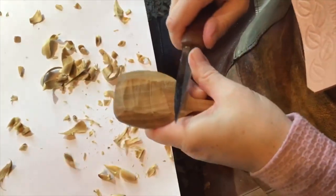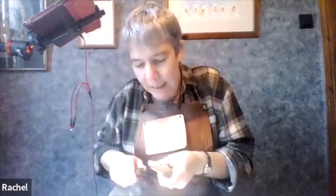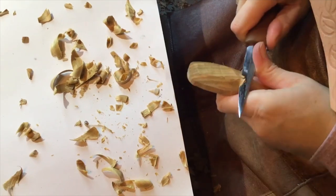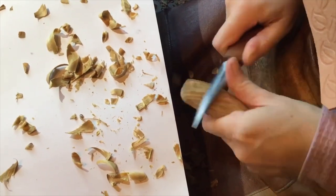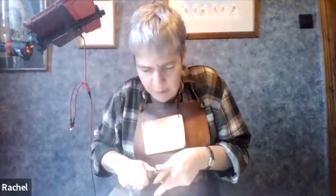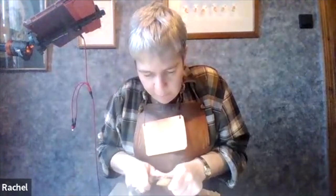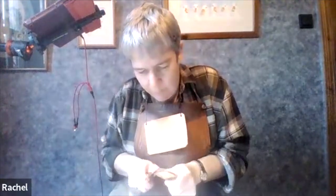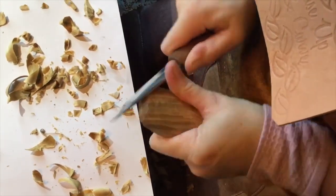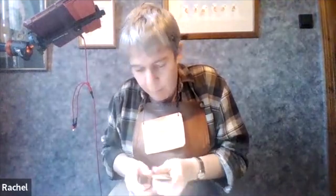Do you do these on a sharp bevel to get down to that? Yeah, on the tip certainly, and on the sides a slightly more angled bevel. I'll do alternating sides. I almost take a facet off one side and then come back and do the other side, working towards the middle. I know some people do the middle first, but that requires too much strength. You have to take more material off, so I prefer working on the sides. Once you've got towards the middle, you can take it down to that chamfer that you originally placed.